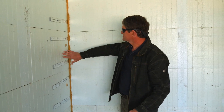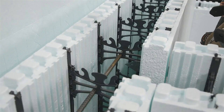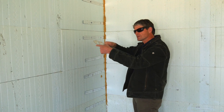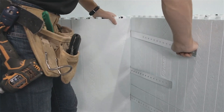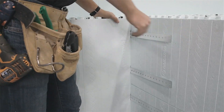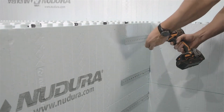Here's the T — this is the main wall, and this is the T. What the installer would do is cut this form just on the inside face of the foam, make a little incision, and just slide this in. It hooks over a piece of rebar that you install in a special way. Make sure you go to our video on our website and watch the how-to T-Strap video, because there's a certain way you need to install the rebar back in there. Then you just screw it into the web and you're ready to place concrete.